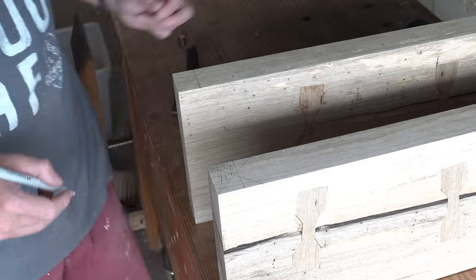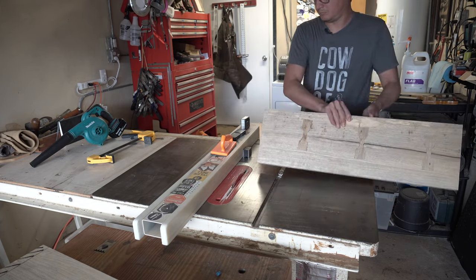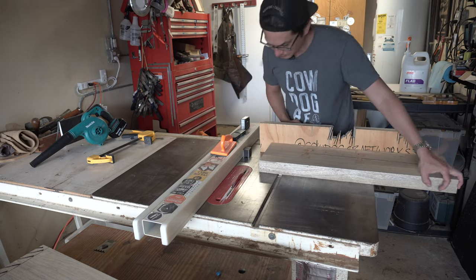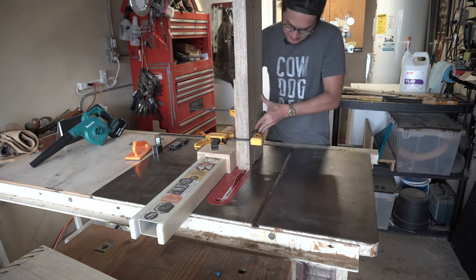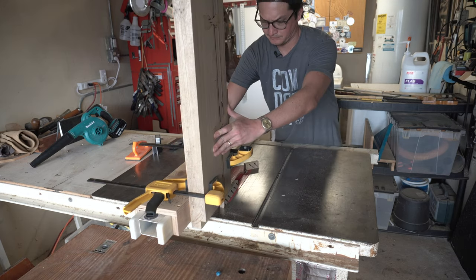What exactly is a ship miter, you ask? Well, it's a miter joint with what I can only best describe as a built-in spline. Essentially, the spline extends from one side of the miter and the other side will have an exposed through tenon of said spline. It's kind of a cool joint.